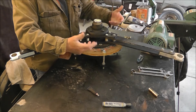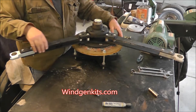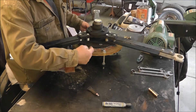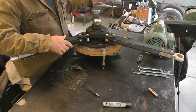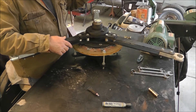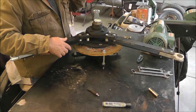So I'm going to take this hub apart, and while I've got it apart I might go get some paint and paint this up. This is a kit I got from windgenkits.com. It comes disassembled — all the parts are laser cut or water jetted — and you assemble it yourself. You have to make your own stator, make your own coils, and buy your own magnets. They offer blades you can buy in 36, 48, or 72 inch lengths, or you can make your own. I've got about six to seven hundred dollars into this by the time I figure in a grid tie inverter.